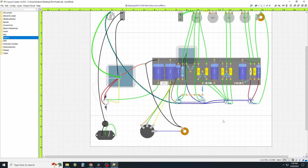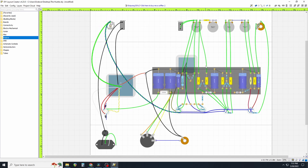Another thing to consider: this ground wire here goes back to the output transformer. The output transformer has the ground reference it uses for the output jack — run it from the transformer to the speaker jack first, and then from the speaker jack to the star ground point or the ground reference point for the amplifier. It's not as clean this way, but you should do it this way.